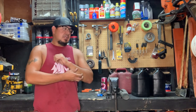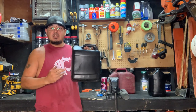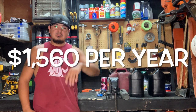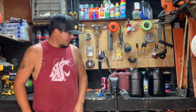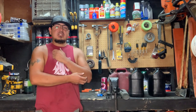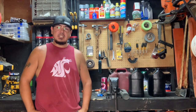The last time I checked it was $20 where I buy my bar oil, and when I was cutting timber I'd go through one and a half to two of these a week — so that's thirty to forty dollars per week. Times that by 52 weeks — I'll drop the math on screen when I edit this video — but yeah, thirty to forty dollars a week just in bar oil. That's pretty ridiculous. Used motor oil is just as good; don't knock it till you try it.